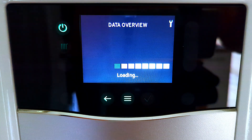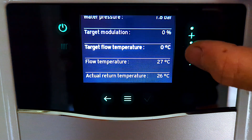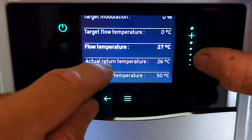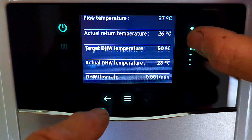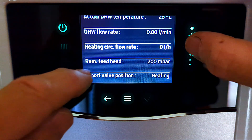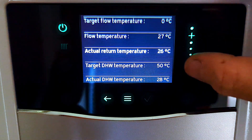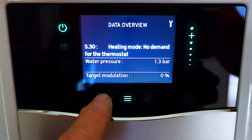Press tick to enter the data overview and there we go - we've got all the information about the boiler all in one place. For instance, if you're balancing the system and you want to know the return temperature, there it is - actual return temperature. So you no longer need to go into the D-codes to see that, which would have been D41. And just so you know, D40 would have been the actual flow temperature. This is a really useful menu that I kind of overlooked at first. Also, when you're in chimney sweep mode you can press that question mark button to see exactly what the boiler is doing.